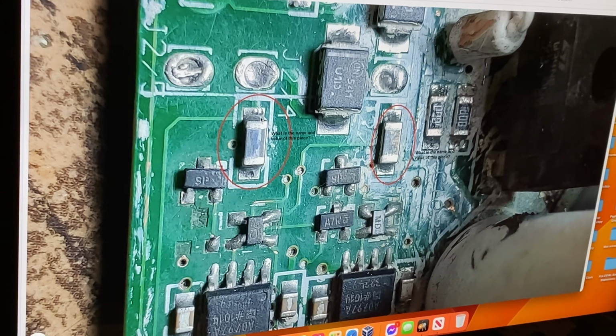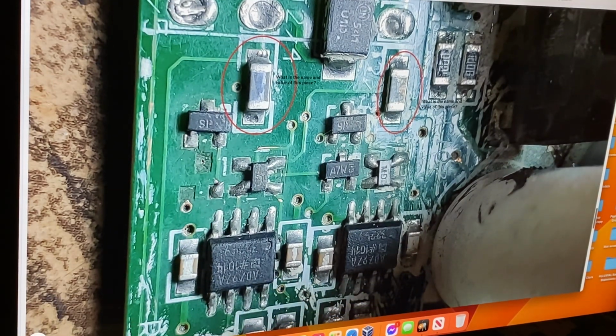It's a 3500, I'm thinking, or a 4500. These are probably about 1 or half a microhenry, and I think very, very low ohmage. You measure it, it's probably 0.1, 0.2 of an ohm. So there's two there, and all they are is inductors, and they are there to slow down the very fast leading edge of the flyback voltage, so it doesn't blow things up. That's all they're there for. Now, also on here, I've noticed there's something that was here. It's not there anymore. That was a BAV99 diode, and you can see there that's its ground pin.